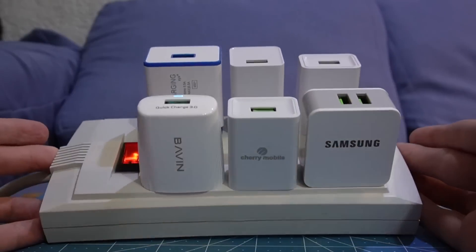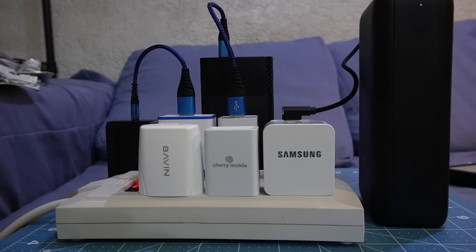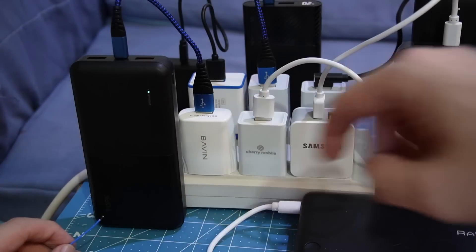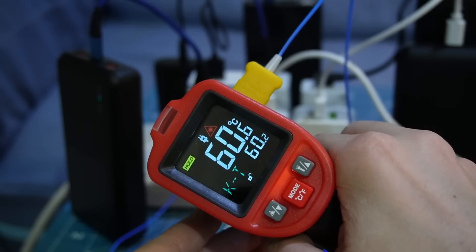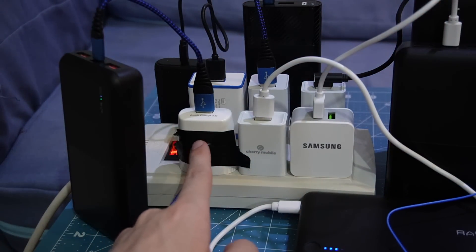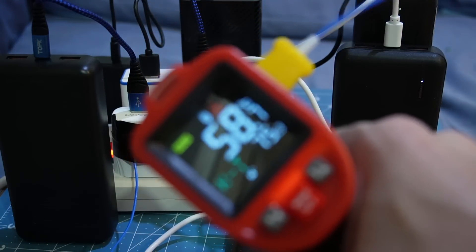So let's move on to a different test. I plugged in 6 USB chargers that claim to be from various brands. Since most of these can only output 1 amp, these power banks are going to charge pretty slowly, but at least we'll get an idea of how hot these chargers get. It's only been a few minutes, but you can already see the USB chargers starting to warm up, especially this one in the corner here. It's been around 10 minutes and the Bavin charger is incredibly hot. I'm going to tape a temperature probe directly to this charger. The other USB chargers don't feel that hot, except this one in the corner — that one's reaching 58 degrees Celsius.